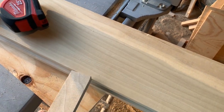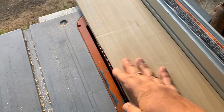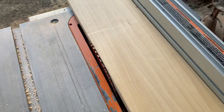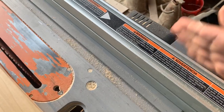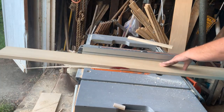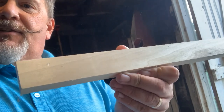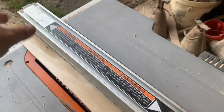Then I'll set my width and use that for the edge that goes against the fence to get a nice straight cut. I've got my saw blade up just barely above the wood — my dad always taught me don't let too much out there. I push my fence up against here, take our piece of wood out, move it over just a tap, close it, and off we cut. Now that I've got that nice factory edge, I'll turn it around and use that edge for ripping. I'll use a piece that's the same size as the rails and stiles to set my fence.